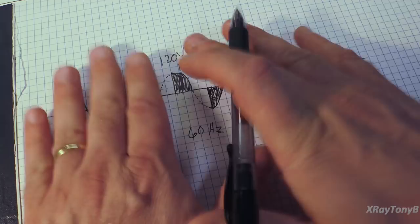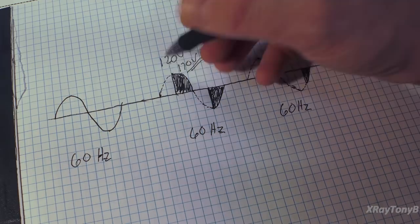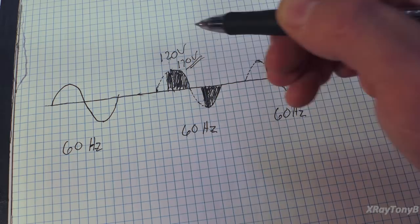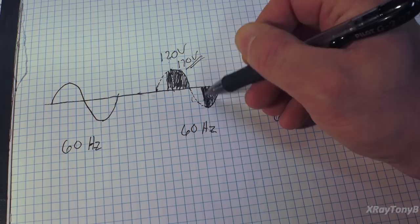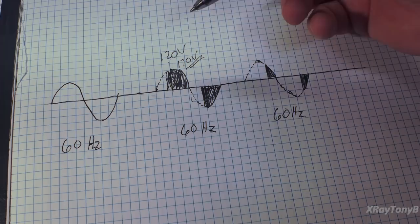At its maximum, that magnetic field amplifier is going to be turned on just a little bit over half the cycle. Those current pulses are actually what feed your capacitor banks, and this here is recovery time for that transformer - unlike a conventional mains transformer where it's doing work all the time. So it does work on the same concept as a switched-mode power supply. However, it is not varying the actual frequency; it's more varying the duty cycle of this particular waveform.